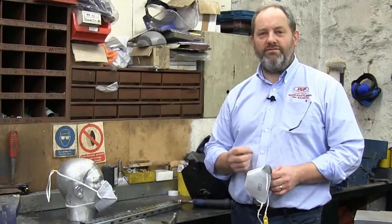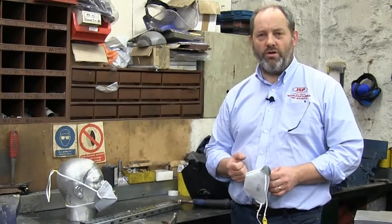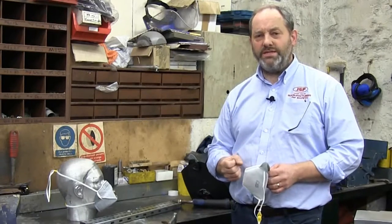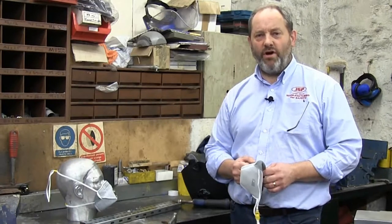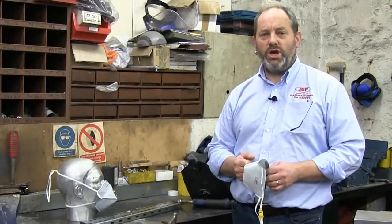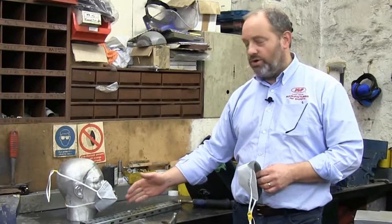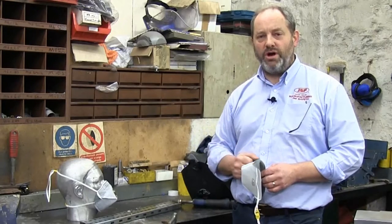Hello, Matthew Judson in a workshop today, just to have a look at the flame retardant nature of the disposable dust masks that we've got for use when doing welding. When you're doing welding, you're superheating the metal with the welding torch, and that's releasing very fine dust into the atmosphere, commonly called fume. What we're going to do is put a mask on the head form here, make some sparks with the MIG torch in front of the mask, and then have a look at the mask afterwards.